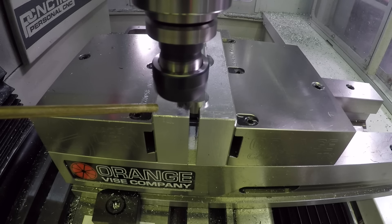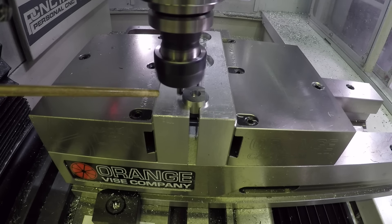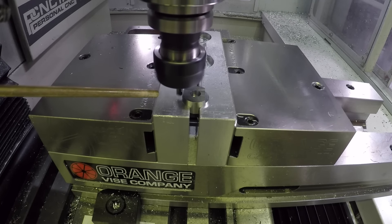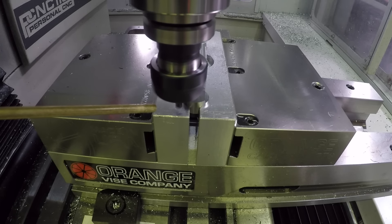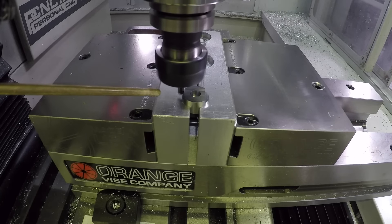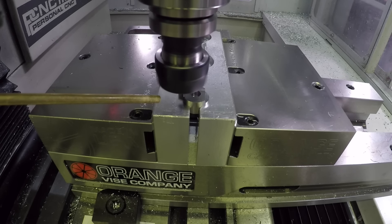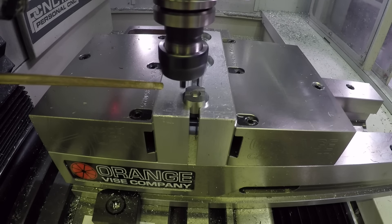What's interesting though is I sent out a job shop job for a pretty large order, and they really didn't want to do it in W1. I got the sense they run O1 all the time. I don't know whether W1 is more expensive in quantity, or — anybody know why W1 is, if it's true that it's less popular, why so? We're going really conservative here — 1,800 RPMs — and six inches a minute, 6.6, but with a four-flute end mill, maintaining a good chip load per tooth, no big deal.